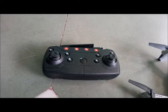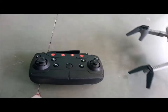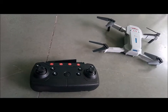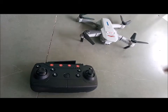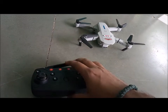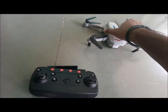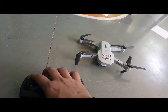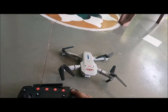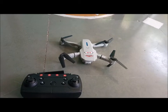Lastly, there is a trim option. Before you go to the motor part, try the trim option as well. If placing the drone on a tilted surface and calibrating doesn't work, then your drone's build may not be stable and it is getting malfunctioned. In that case, use the trim keys as your last option. If your drone tilts to the left, press the left trim button; if to the right, press the right trim button; if going forward, press the backward trim button; if going backward, press the forward trim button — until the drone is stable.